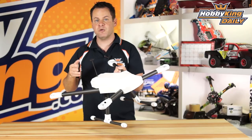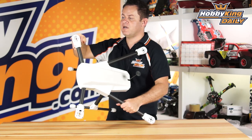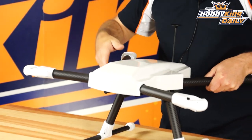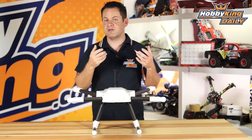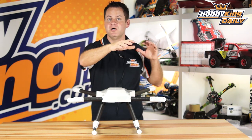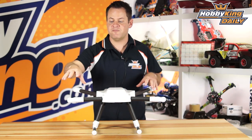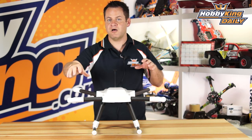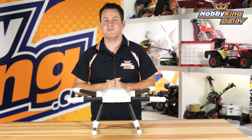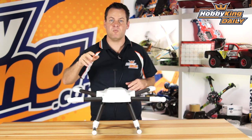This is configurable to an X8 configuration. We have motor mounting on the top and it also has mount pads on the bottom, so you can mount a motor on top and bottom. X8 configurations are great because they have redundancy — versus an octo where if you lose a motor the other two have to speed up to compensate and it could tip. In this style configuration, since there's no unequal thrust, one motor can easily spool up and compensate. You can drop or throw a prop and you won't even see the multi-rotor twitch.